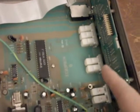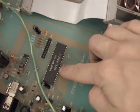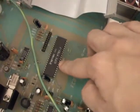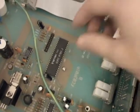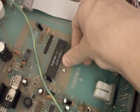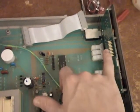So I think the easiest way to interface this — we have two options. Number one, we try to look at the pins on the output of the chip, and there is a pin — I think it's the sixth, seventh, or eighth pin somewhere around there — that does seem to output a small burst of data, and I can see that on my analog oscilloscope. But because I don't have a digital recording scope or a spectrum analyzer, I don't really have the ability to tell what type of data is coming out of here. So I'm going to have to do a little more old-fashioned hack and try to interface the data as it goes between the microchip and the display.